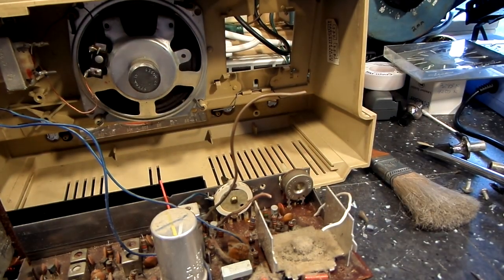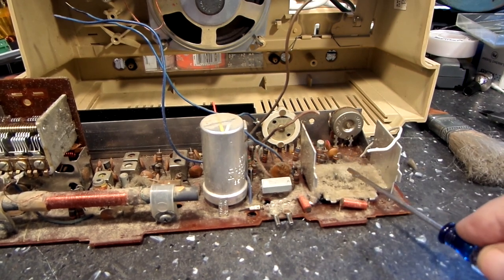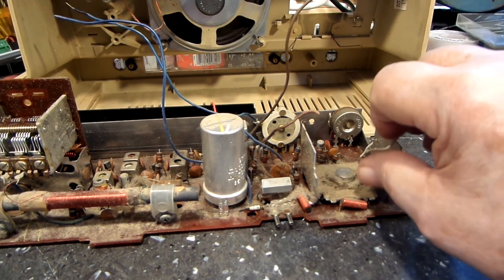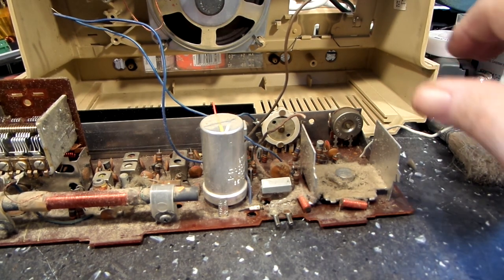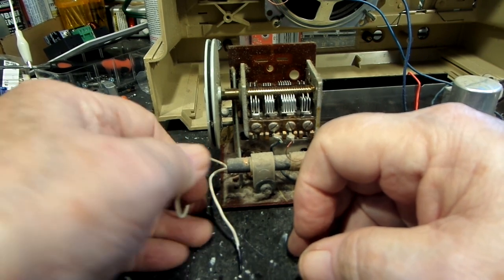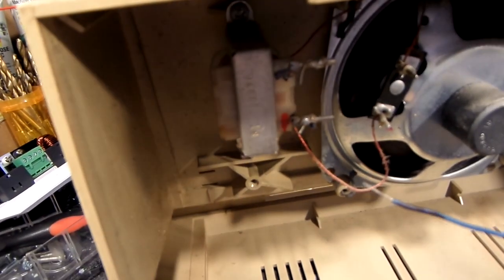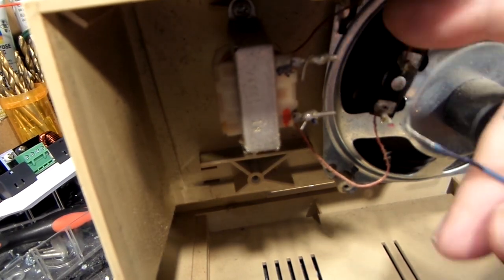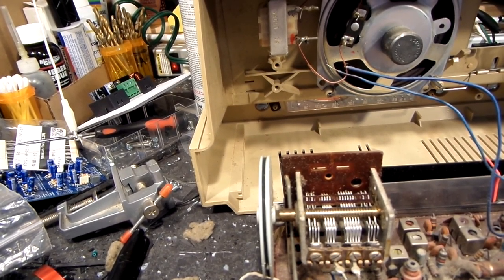So that's it in a nutshell. Doesn't seem too complicated. As far as the circuit board is concerned, it definitely had some dust bunnies living here. I've got my little brush — I want to brush it out and try to get some of these wires out of the way. But I don't want to mess them up too much so I'll know where they go. All the antenna wires — I marked one black and the other white, and I will solder those back onto the back of the antenna. Same with the speaker wires — it's already got a red mark on the positive side, and I marked the other one black. I'm not going to bother taking the speaker out — I don't think there's any sense in it.